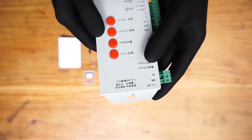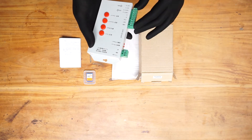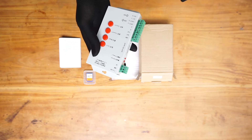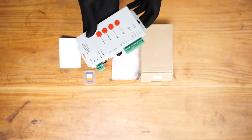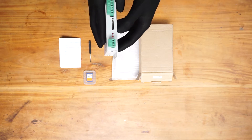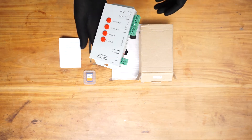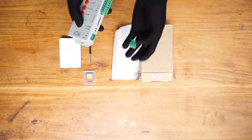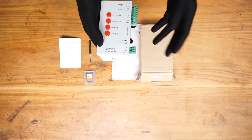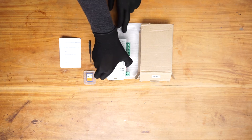There is no mention about the model number. These are the push buttons for various settings. The first five terminals are for connecting various types of pixel LED strings or strips. The last four terminals are for networking pixel LED controllers. This is the SD card slot, and these two LEDs are for error and power indication. These terminals can be removed by pulling out and put back by pushing. So you can easily swap controllers if the pixel LED controller doesn't work.